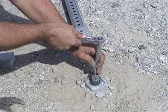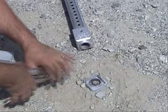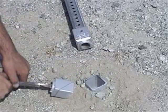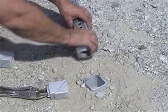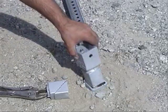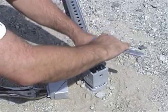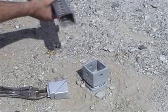To replace a sign after a knockdown, simply loosen the wedge by turning the center bolt a quarter turn, grip the bolt with locking pliers, and remove the wedge and bolt so they can be reused. Remove the remaining portion of the coupler from the top post. Install a new Breakout in the anchor and attach the post to the coupler.